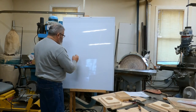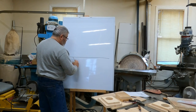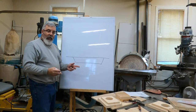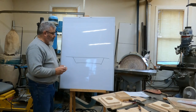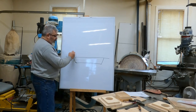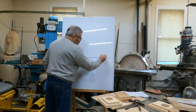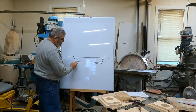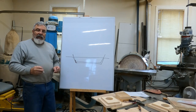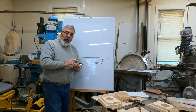all right, so I'm going to make my mold. Say this is my mold, and here's my 10 degree draft on my core print, okay? That's the hole my core print made. If I round these corners in here, when I go to set my core in there, if these corners are rounded and my corners are sharp on my core, it's not going to go all the way down into the mold, okay?